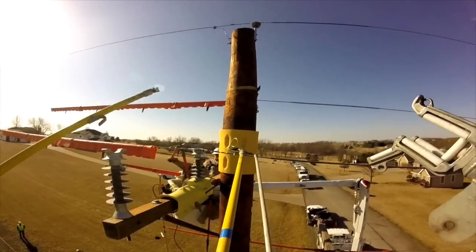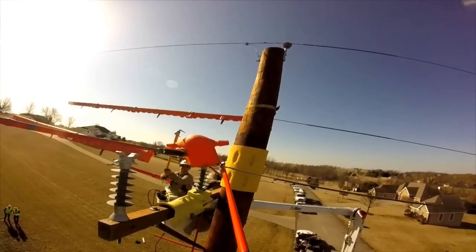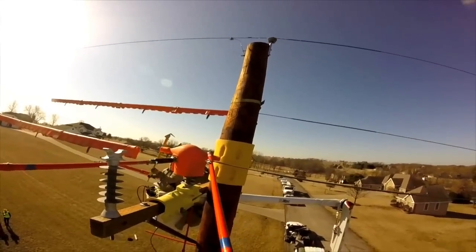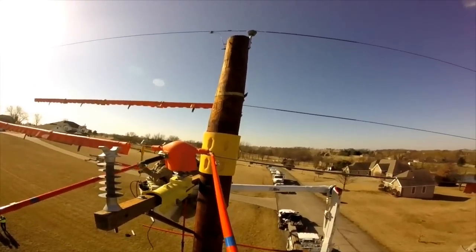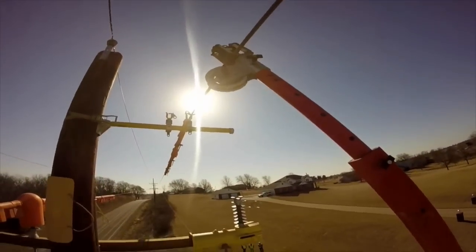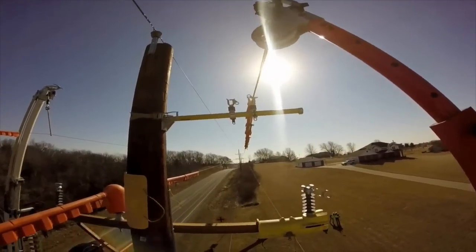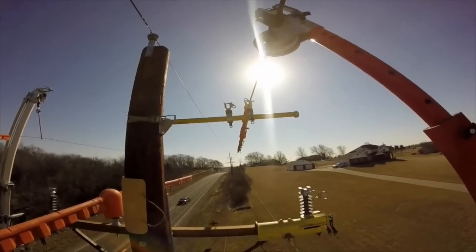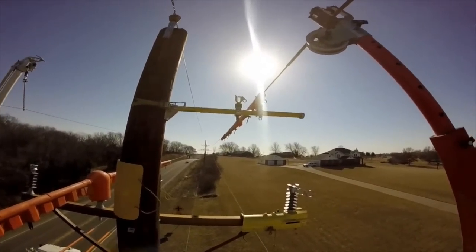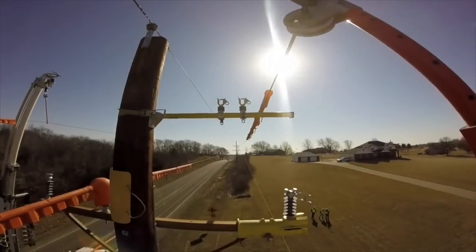There's the hot cutter again, cutting part of that coil off the line — that's the first line secured. Now they're going to put what's called a conductor hood, or insulator cover, over this to protect against any incidental contact. Remember, we're going to see them do two more lines. Now we're moving over to the other line — you can see it's on a temporary home called a hot arm, which the jib is going to pull it free from.